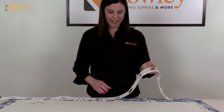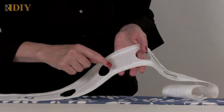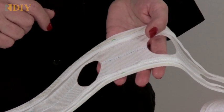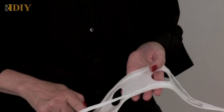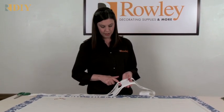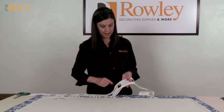Before you start, let me show you a few features of this tape. One thing to look for are these little green repeat-indicating threads — I'll show you how to use those as we go along. This tape also features shearing strips at the top and bottom that allow you to pull up your panel after the tape is on so you can adjust the spacing. That's unique to this tape.